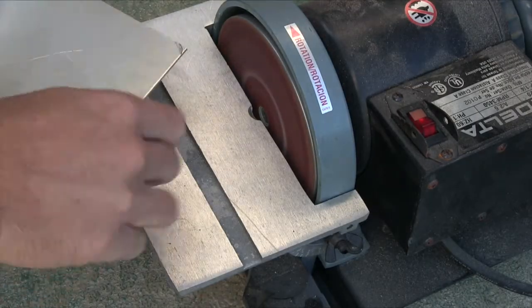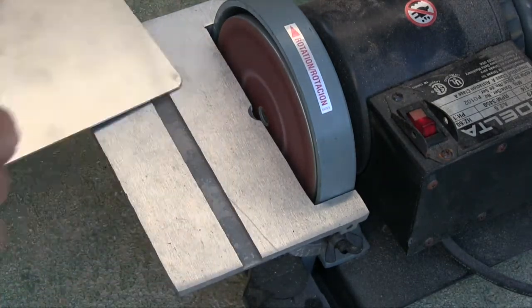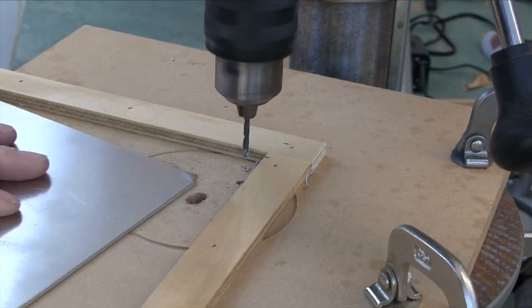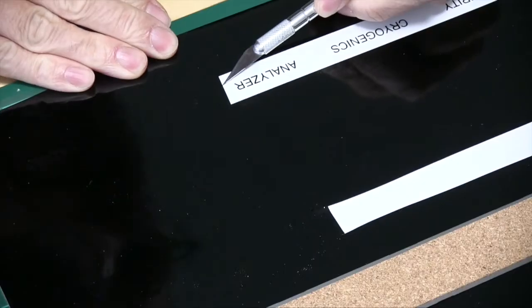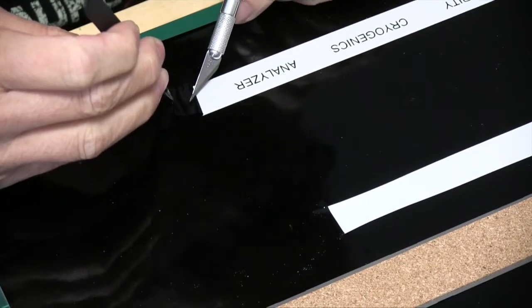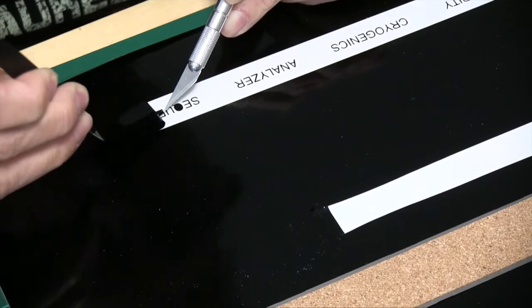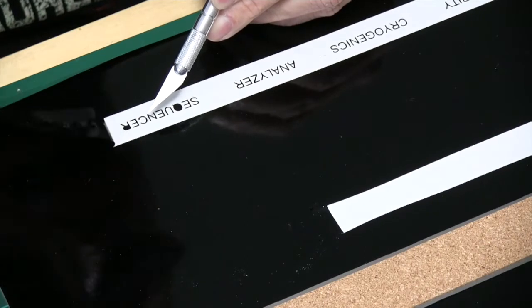Then it was time to cut the individual six metal panels. I used the same acrylic and non-ferrous metal cutting blade — an 80-tooth blade — on my table saw to cut the aluminum sheets. Next I used my mini dedicated sanding center to round off the corners of all the plates. Then I made a little jig for my drill press to slide each plate in, drill the hole, quickly turn it and repeat — 24 holes total, making everything go very quickly. For the remaining holes I used a combination of my drill press with step bits and a jigsaw with a bi-metal cutting blade, cleaning up all edges with sandpaper or a file. Then I sanded the entire sheet with 150-grit sandpaper and an orbital sander for a nice textured finish.